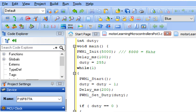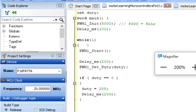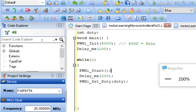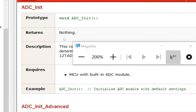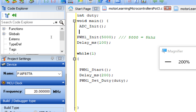Since you can see the code, PWM1 was initialized, there was an initialization delay, and the initial value was 255. Delete those lines. Now the new addition is the potentiometer, so we initialize the ADC pins. Go to the ADC library, click on ADC, expand it, select ADC_Init, and double-click. In the example, copy the ADC_Init command and paste it right above the PWM1 initialization. Also give it some initialization delay — if you give it, it's good; if you don't, it doesn't matter much, but it is preferred.